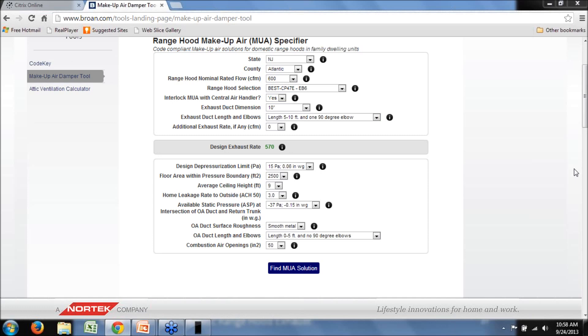A question from Paul: the approach of allowing outdoor air into the HVAC system is a disadvantage because of a large influx of outdoor moisture. What is wrong with ducting the outdoor air intake near the exhaust hood to reduce the risk of elevated indoor relative humidity? Nothing at all — if you're able to introduce the outdoor air near the range hood, that humid air can more easily be exhausted before it has a chance to mix fully with the indoor environment. So in a very high humidity area, that might be a good consideration. Based on the earlier comment, another way to deal with it would be to actively dehumidify that air.